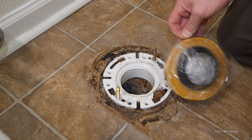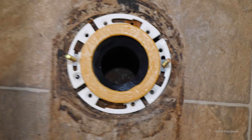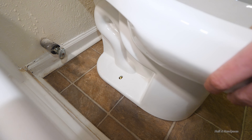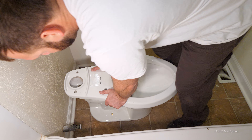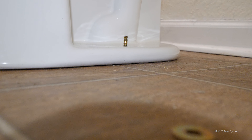Now it's time for the wax ring. These things are generally a one-time use, so be careful. Let's make sure it's centered, and go ahead and set it on. Remember, you're going to have to push down on the toilet to flatten out that wax ring. See this gap? Let's get rid of it. All I'm doing here is making sure it's positioned right and not cockeyed. Now you're going to have to put some weight on it — a whole lot of weight. Right now most of my weight is on the front, but you really need it over top of the wax ring itself. And we're good — it's finally flush.